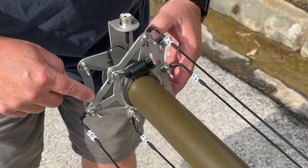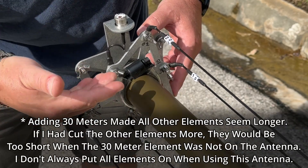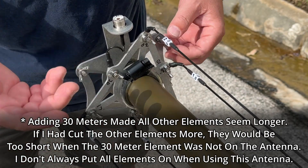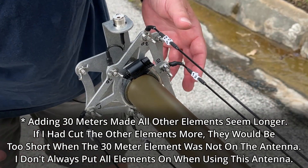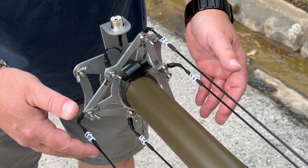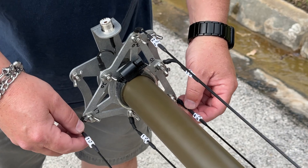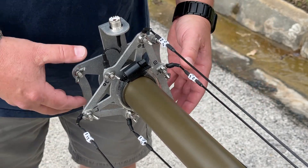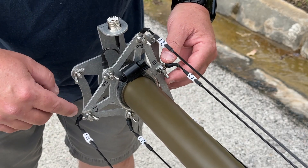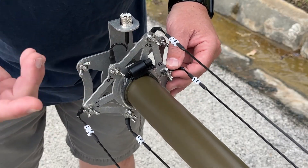Also on this driven element plate, I went ahead and marked where each element goes. I actually made one for 30 meters too, but I found when I had 30 meters on it kind of threw everything else off. So I didn't have the best of luck putting 30 meters on with all the others, but I do have a tuned 30-meter element if I want to throw it on — it just detunes everything else. So I put all these elements on, tuned them all at once, and took readings for 40, 20, 17, 15, 12, and 10, cutting each time. Having these marked where they go is important because they do need to go in a certain place per Callum's instructions. I just hit it with a Sharpie — no problem.